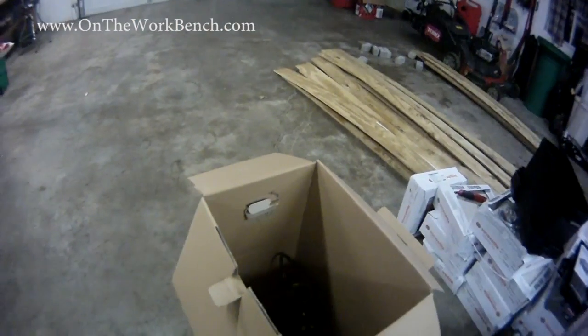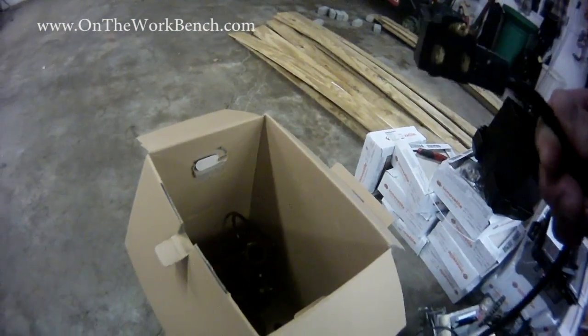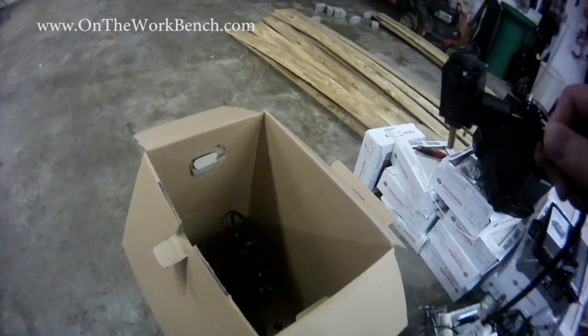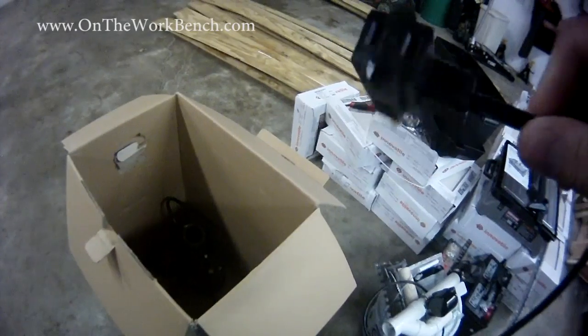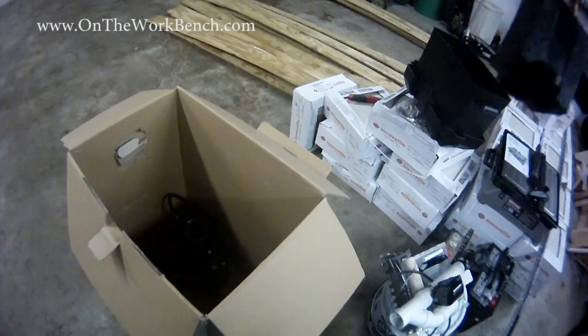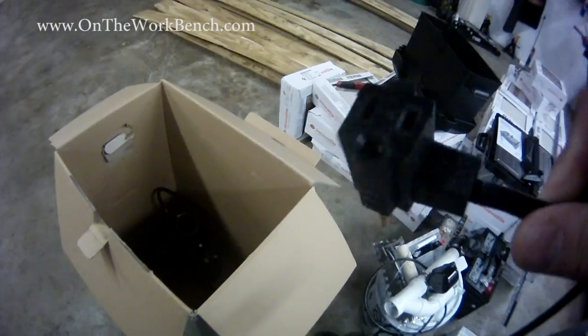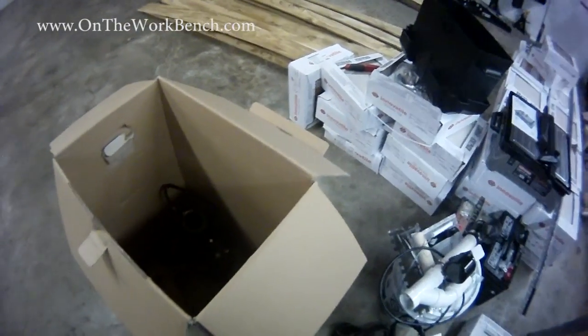Here's our other cord. This cord has a pass-through — you can plug it in and then plug another cord into the other side of it. This is actually the float switch that goes with the main pump. There are two of these that are independent, so you can replace the float switch separately from replacing the pump in the event of a failure in the future. It's a nice added feature.